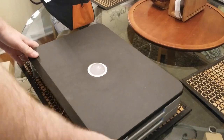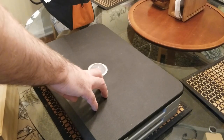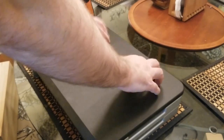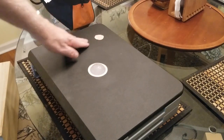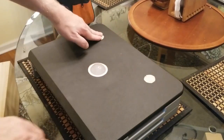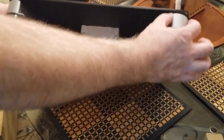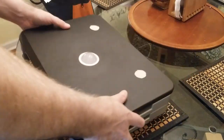So anyway, we got the 2 1/4 inch hole for the trackball right in the center of the case. And next you wanna decide whether to place the Tron joystick up here on the left side or on the right. Now in the arcade, you had it on the right, and then you had the spinner up here on the left. So that's what we're gonna do. We're gonna place those. And you probably wanna use masking tape, maybe eyeball it at first and put your masking tape delineating spots right where you want your joystick and your spinner.